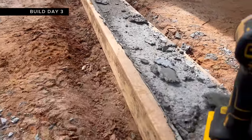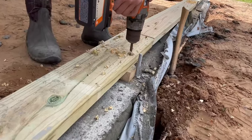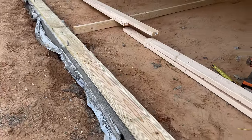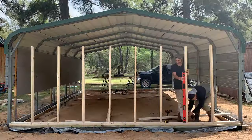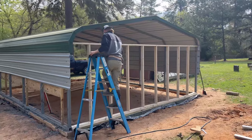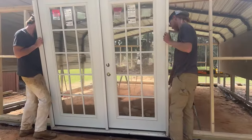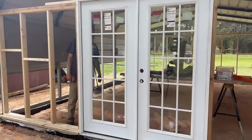We started day three by removing our mold and prepping our base to mount our studs. We used a piece of treated lumber as our base and drilled holes to match the location of our bolts — using treated lumber will hopefully avoid any rot over time due to ground contact. We then measured, cut, and studded out our wall as we normally would. After the rear wall was completed, we quickly moved to the front and repeated the process. Because of our short time frame together, we decided to go ahead and install the French door now and finish up the studs for the top of this wall tomorrow.